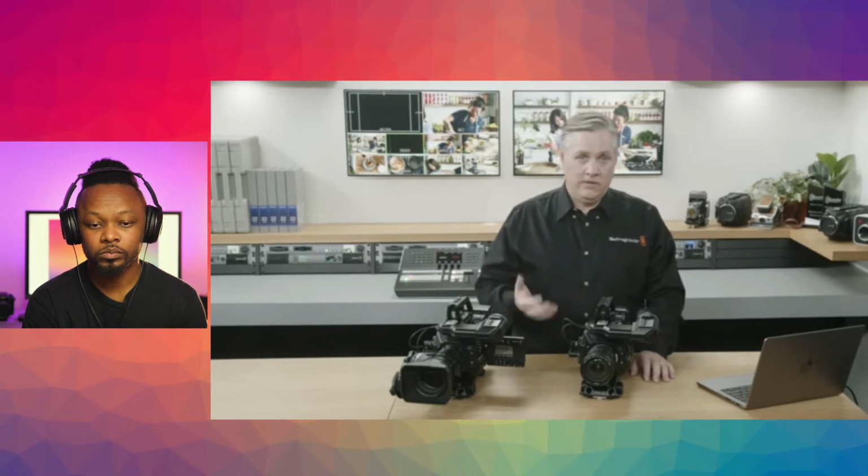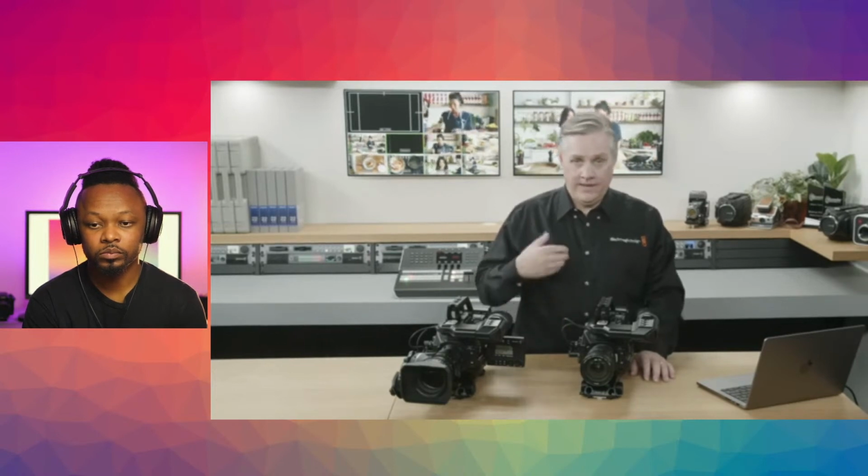So it's 25,600 ISO, which means you can add a lot of gain. It's dual native ISO for low light sensitivity, and that's 0 dB and 18 dB, or it's kind of 400 ISO and 3,200 ISO in the different language. There's also 13 stops of dynamic range, so it's much better than the older model. It's an amazing low light camera now.